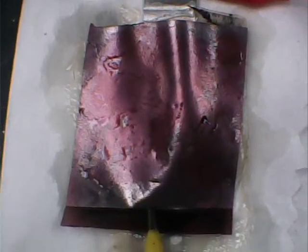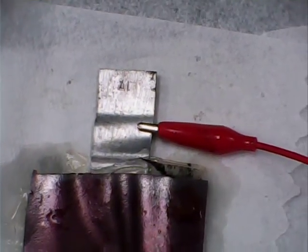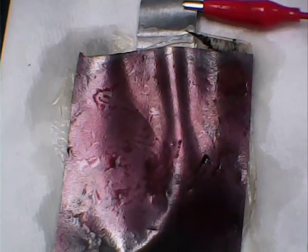Right now that thin film is wet with aqueous solution, but I want to see if it continues to function as the water evaporates. One thing I know right away is that it is passing through the membrane. Here I have Murray Smith's polypropylene sheet rubbed vigorously with graphite flake — that is the cathode. The aluminum of course is the anode. I have the membrane there in place, soaked with the sodium hydroxide solution. We'll see over the next three or four days, as that water evaporates, if that membrane will continue to be functioning.